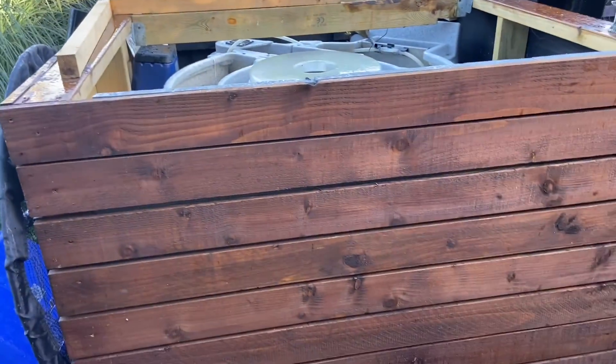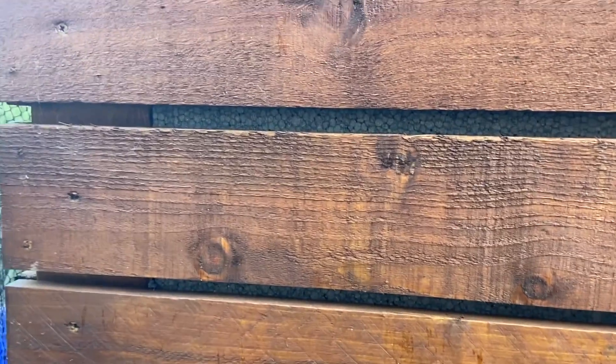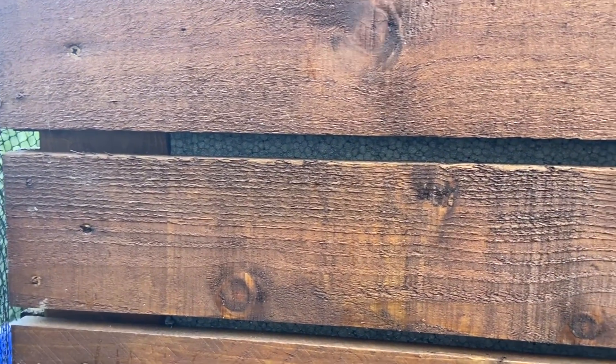Okay, these are all done, all nicely screwed in - they're not going anywhere now. Done the insulation on that side as well. They're all fitted in from the side, screwed on as well. So now there'll be no sort of draft coming through the side of the box. As you can see, all this had about a centimetre and a half gaps in between there. So now they're all nicely insulated, so there'll be no wind coming in from the side into the filter box.